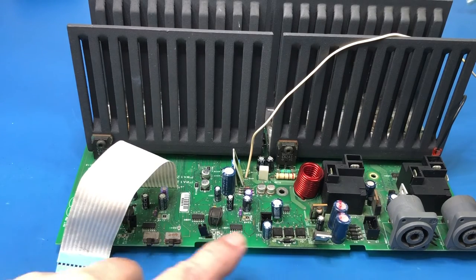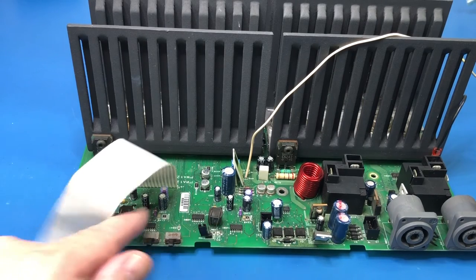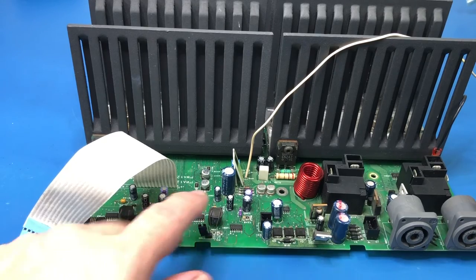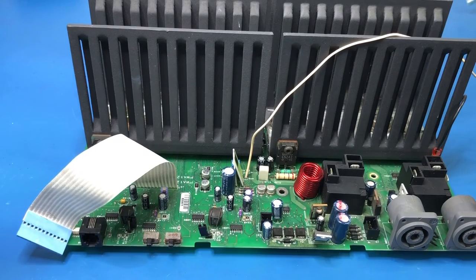there's these op amps over here, and I wasn't finding any voltages on these op amps over here. There should be plus or minus 15 supply on these op amps, 1, 2, 3, 4 of them. And there was no supply voltage there. So